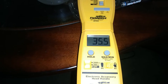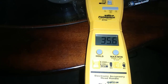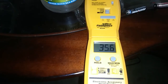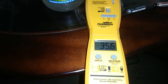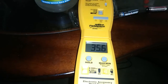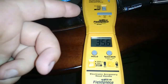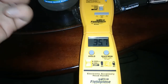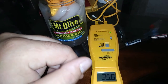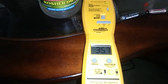They're off by a couple degrees — it should be reading 32. I'm pretty sure this is well stabilized; there's a lot of ice in there. They're both off by three and a half degrees, but they're off by the same amount, so I can interpolate or change my calibration. These are probably the thermocouples I'm going to use the most, so maybe it's a good call to just calibrate it to that.